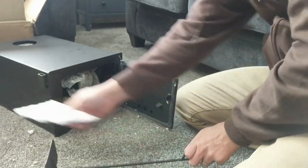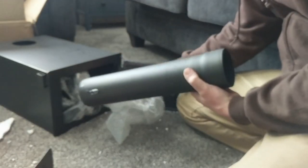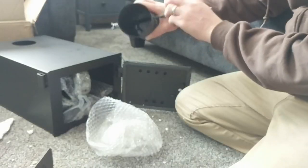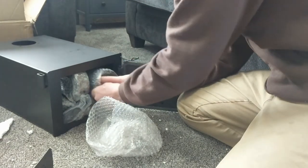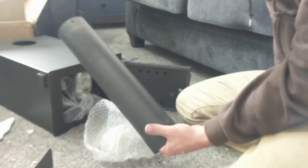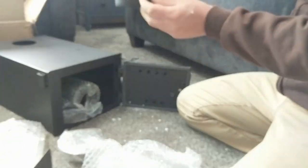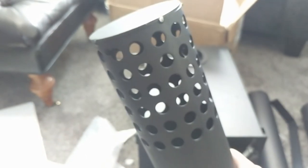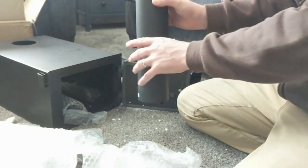It has a little coal scraper, which is nice. The stove pipe itself is a — I call it four inch stove pipe. It kind of interlocks with each other. The actual dimension is like 3.37 inches. It has a cap pipe and then a part where you can control how much air is going out, and then also three other lengths that are 15 and a half inches long. So when they're all put together, you have a total of 77 and a half inches of stove piping from the top of the stove, which is pretty cool.